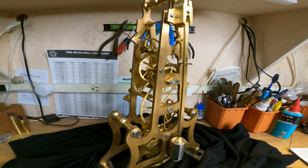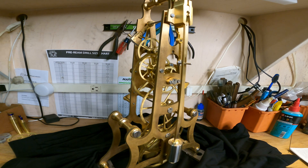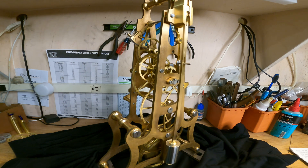What I need to get into now is the motion work — that's going to be a bit of a trick. I've discovered some problems with this design: there are dimensional issues with how this train is laid out that we're going to have to fix. In the next video I'll probably show part of that train getting put in place on the front and start to make this look more and more like a clock. Remember, this is a perpetual calendar, so it's one of the more complex skeleton clocks you'll see being built.